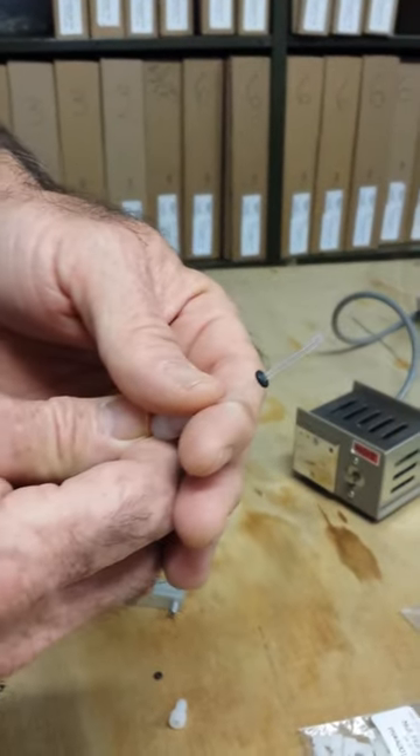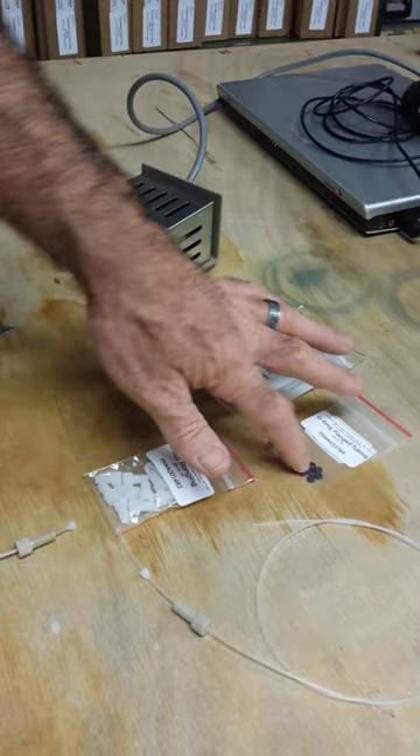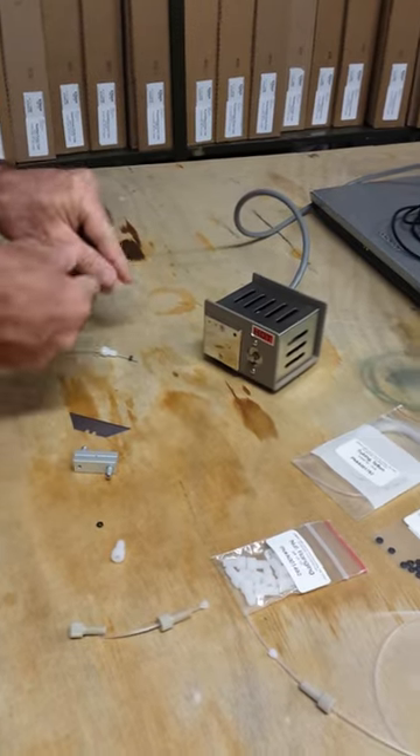It's overall a Cadillac type of tubing that you should be using throughout your system. In order to do that, you need to create what's called a flange, and this just requires a package of nuts and some Viton chemical-resistant o-rings, which are nice and soft and compress when you screw them into the fitting.